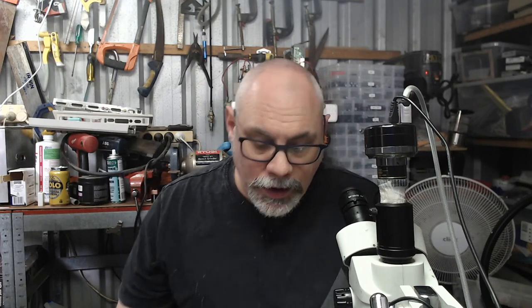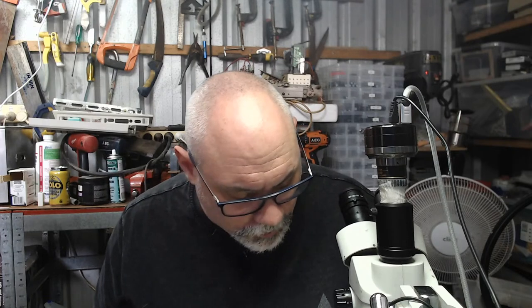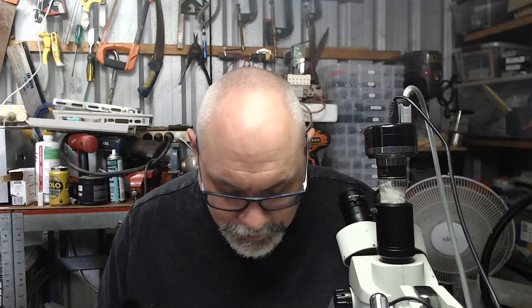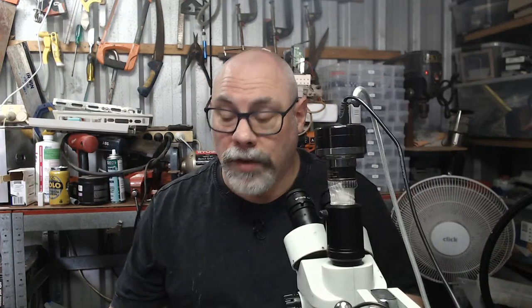You think it may be getting power. Okay, I'm putting in a startup disk. When putting in a startup disk, the disk will eject. That's definitely getting power. That's getting 12 volts. It won't be able to eject it without 12 volts. So that's something else. Yes, look, it could definitely be the floppy controller. I don't even know where that is on this. I'm sure I could find it with a schematic, but somewhere here. Yeah, I'll have to look that up. But I can't tell you much more than that, unfortunately. My apologies for that, Charlie.